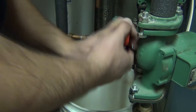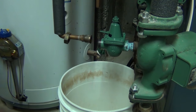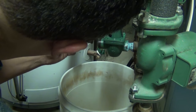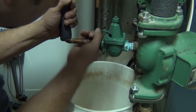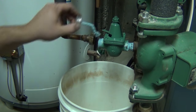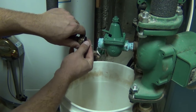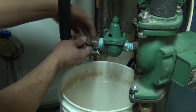Alright, I think we're good there. The union on the new one comes with a new gasket — we're going to put that on the old union. The previous guy apparently never put a gasket on when he put this together, which is really weird. We'll put that guy on there and hook this back up. Some guys might not like this but when I'm putting a union on I put pipe dope on it too — doesn't hurt anything, and if anything it lubes up the fitting so it goes together a little bit easier.